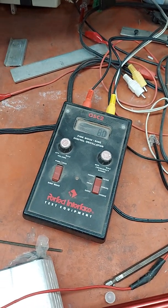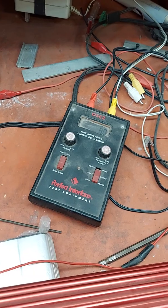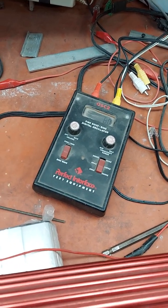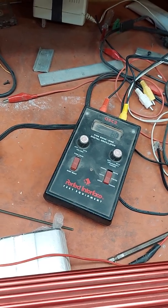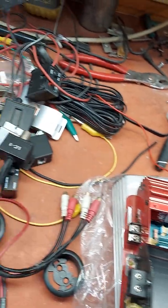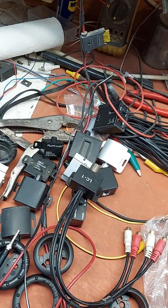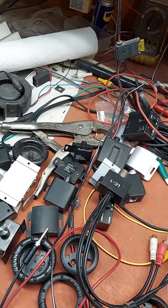Your amplifiers have a typical input impedance of about 10 kilohms — sometimes 20 — depending on how they design it. And the head units: there's a huge trend about having a 4-volt pre-out, or a 5-volt pre-out, or even a 12-volt pre-out.